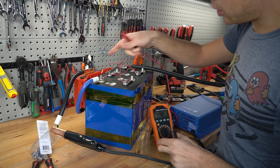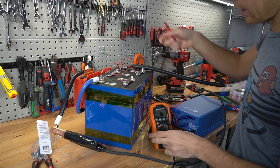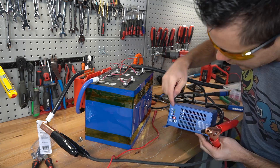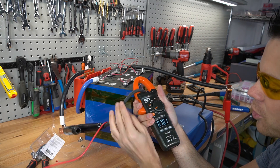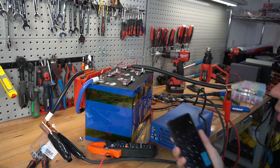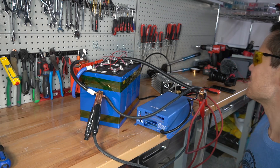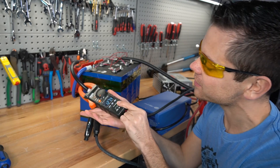We have power. This huge Daly works just like all the other smaller Dalys — you just have to short out B negative to P negative. We're going to use an Ames Power 75 amp charger; I really like this charger and you can adjust the current. We're charging at 70 amps, which means it will take four hours to charge this battery to full. I added a second 60 amp charger and overloaded the circuit, but now we're charging at 127 amps — incredible.